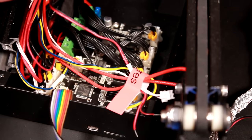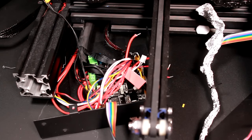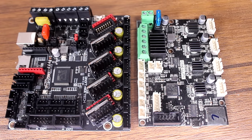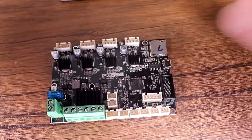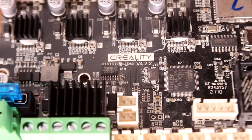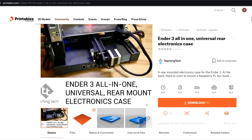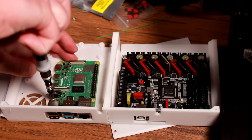Fitting the board is actually easier than it might appear. You just have to unplug everything from the old Creality board and, after some choice words, separate out the wires and route them out the back. Your new board will not fit where the old one did because Creality boards are really tiny — mainly because the chips are soldered on so they don't have to make room for the plugs. The best option for a case for the Ender 3 seems to be Teaching Tech's case. Print it before your printer is in bits. Four short prints later I have the case ready.